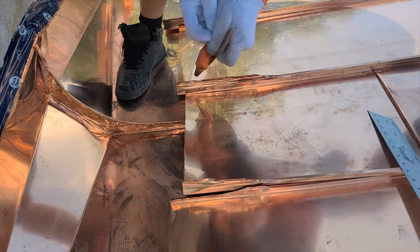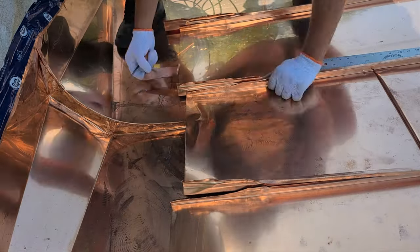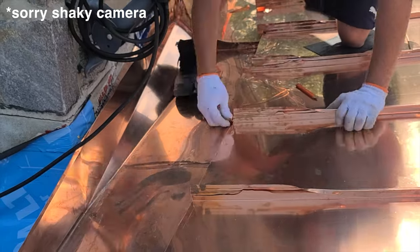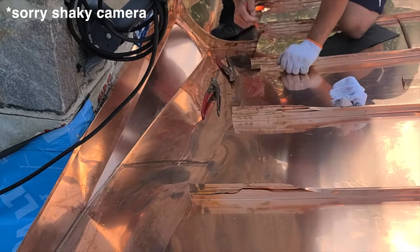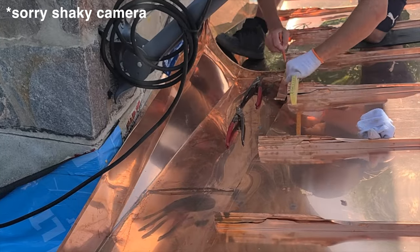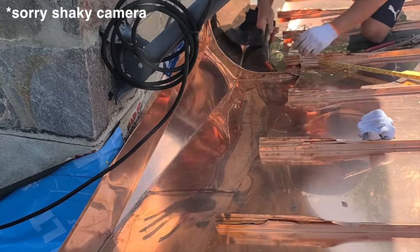You may be looking at this portion of the video and wondering why I did not pre-bend the panels before installing them, to avoid having to make all these lines and cuts after the fact. Yes, it is more difficult to do this way, but there's a very specific reason: we have to double fold the ends of the seams before we turn the valley hook.